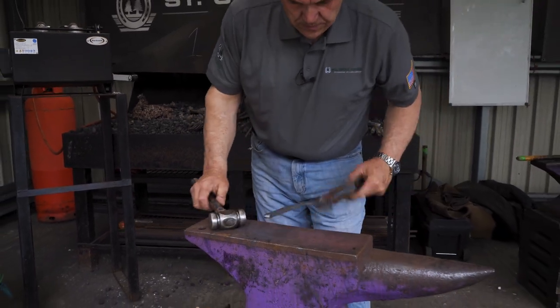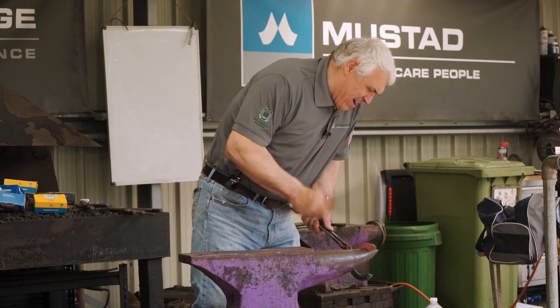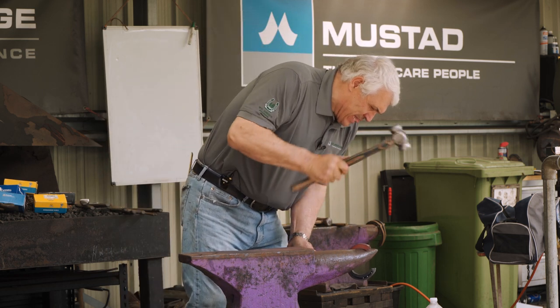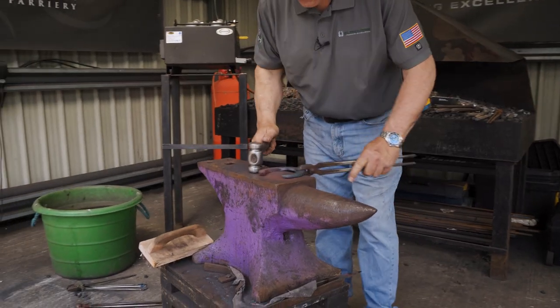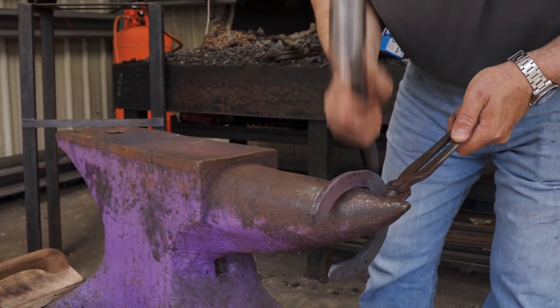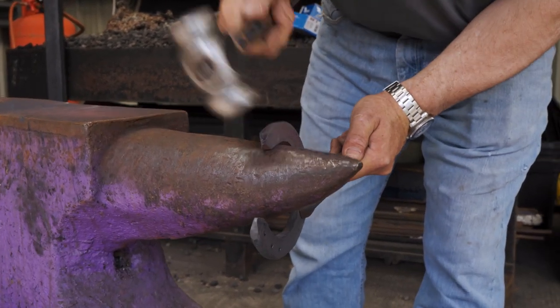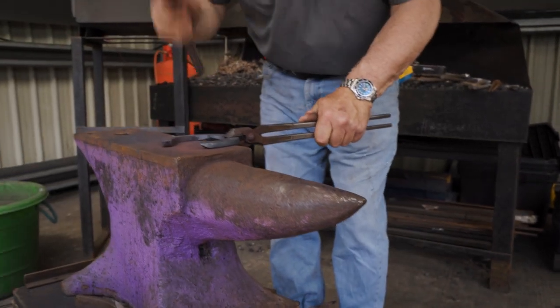Now I'm going to do the last branch. Bend it a little bit like a hind now, keeping that — almost like a heel quarter on a hind. Hem it, up the horn, to the quarter, over the horn, and away. That really reinforces the shape.